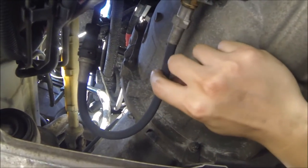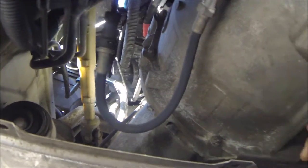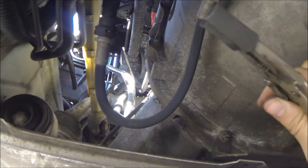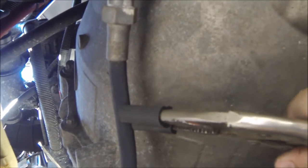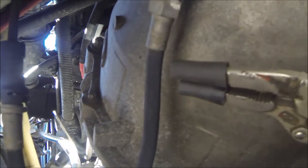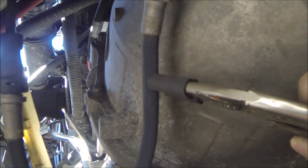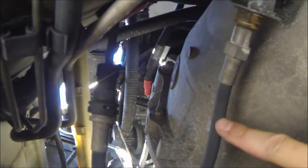You're going to want to clamp off this hydraulic hose, and the way you do it is with vise grips. One pro tip I can give you is to use some tubing to cover the ends of your vise grips so that when you're clamping onto the hydraulic hose, you're not clamping on it with metal. That'll save your hydraulic hose from getting destroyed.